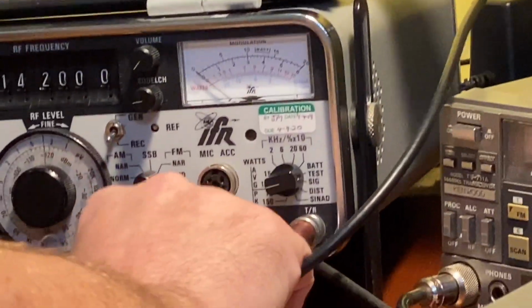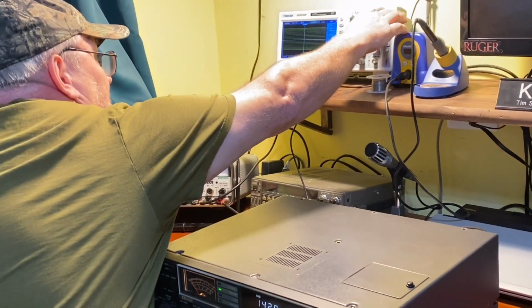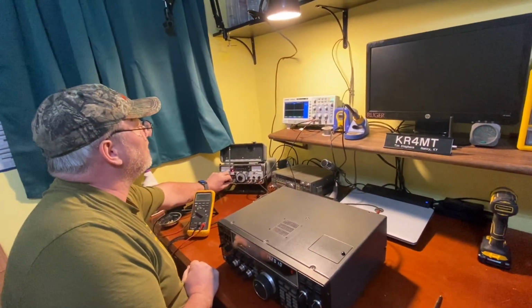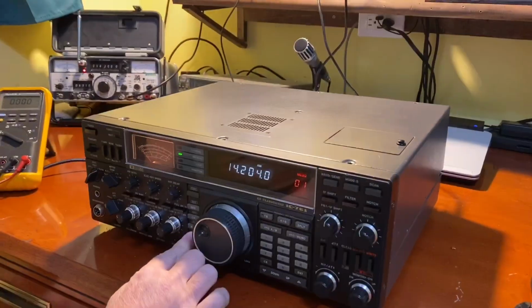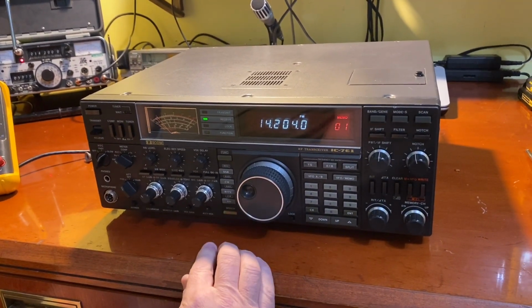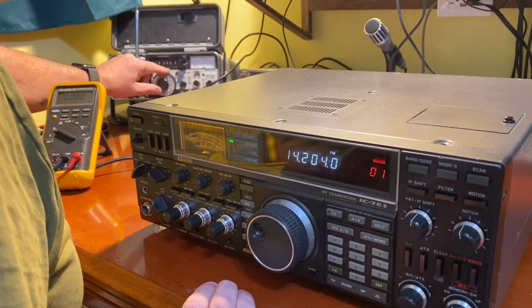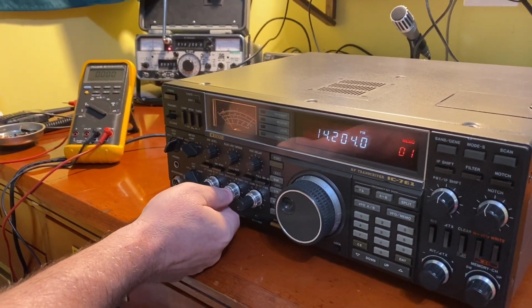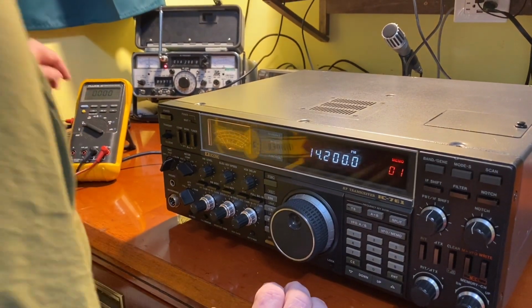Let me hook my channel 1 up so we can get the demodulated signal out of my service monitor. Let me set it up here. The audio set. Okay, that's my tone generating from the service monitor here. So, let's go to FM if it has it. Pretty quiet. Center squelch, whatever that is, not going squelch. Let's go to 14.2 even on FM.